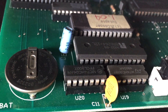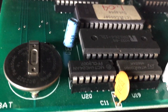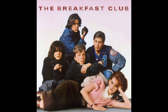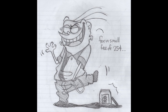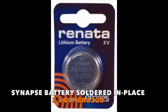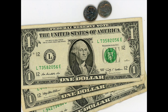As was typical for this era of electronic instruments, this patch bay lacks a user-replaceable battery. Coin batteries such as the one installed in the Synapse were often soldered to the main board. Back in the day it was probably a cost-saving measure and an opportunity to have an authorized JLCooper Service Center charge the gear owner a small fee for an easy task. The workaround is to bravely open up the patch bay and replace the factory battery with a new battery placed in a coin battery holder — patience, a steady hand, and about $3 is all you need.